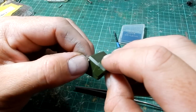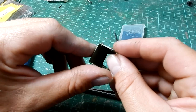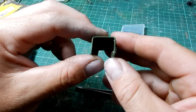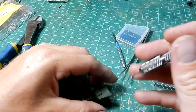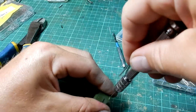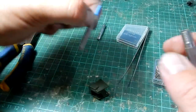That's how we do those sorts of details with pins. Now I'll go through one more quick detail technique. As you can see, these pins are raised, but there is actually a way we can recess them down into the plastic. It's a little bit tricky but simple at the same time. We'll make a new hole on the other side using a larger drill bit.